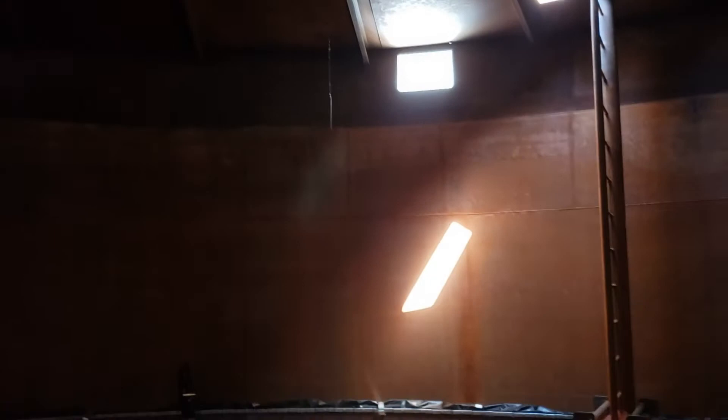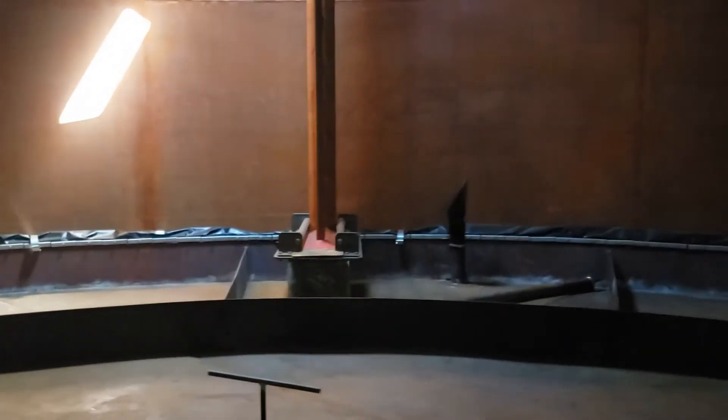You just pull the legs out and either set them on the roof or put them in a rack. I want to point out that there are multiple roof rafters that are bent — just deformed. This tank has had some serious events in the past and some of the roof rafters are bent, but it hasn't pulled them off the center stand — they're bolted. The roof looks in overall decent condition; the roof deck's not corroding, neither are the rafters, so they decided not to touch them.